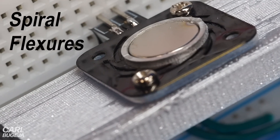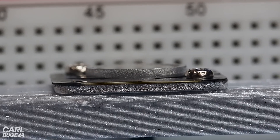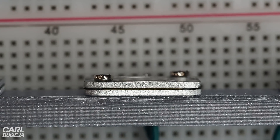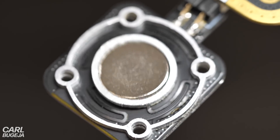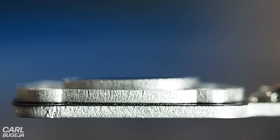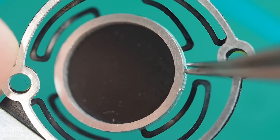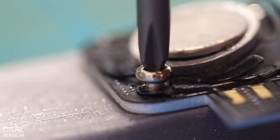The only other survivor was clearly very unstable compared to the other multi-arm geometries. The spiral designs had the most disappointing performance with the coil — they were barely moving. The thinnest option got the best performance but was still poor compared to the other two flexures. The 4-arm zigzag performed slightly better than the circular flexure and was the best out of all 40 flexures tested. Both the non-copper and copper samples achieved the same distance, so I went with the non-copper flexure with the aluminium frame, which made it a bit heavier but was required for mounting.